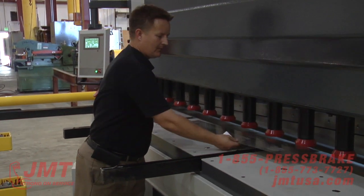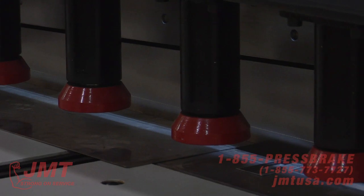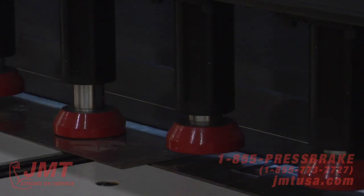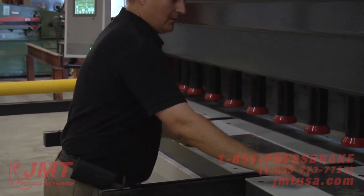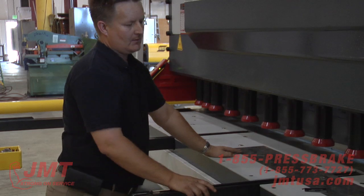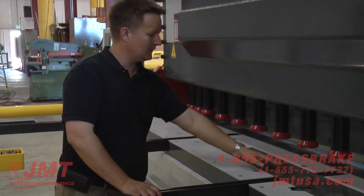I've got a piece of thin stainless here — 24 gauge. I've also got a business card here; this is a pretty thin card. I'm going to put this card in here. Stainless. I tripped my laser, so I've got to reset the control. I'll go ahead and shear this. No burr whatsoever. Power blade gap on this size machine is critical for shearing thin material, but it's not only changing the blade gap — it's changing the blade crown. It affects how tight the blade is in the middle compared to the ends because of deflection. This machine is built like a tank out of basically armor plate, but two or three thousandths of deflection will affect this. The control knows that and adjusts it automatically in the bed for whatever blade gap we have.